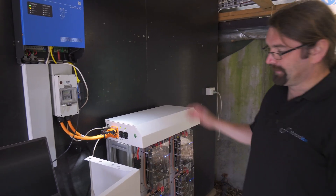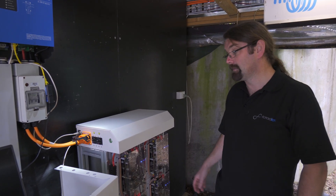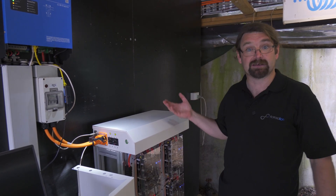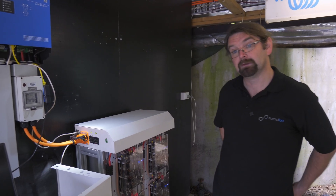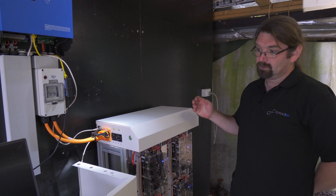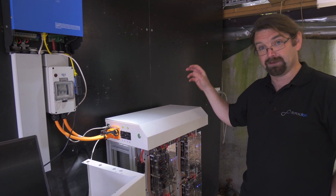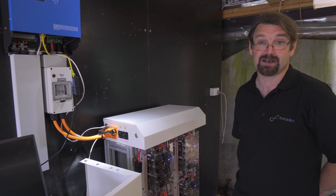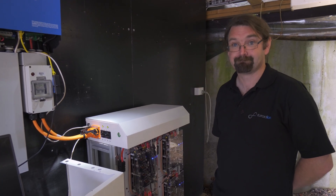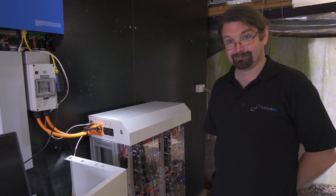What do we call this area at the top? These are the electronics bays. The power electronics and the master controllers for all these different boards are all held in here. It has things like fuses, contactors, and any CAN processing parts. The circuit breakers here are a bit unusual — they move. They're remote-actuated units. Rather than being a normal circuit breaker which you flick on and off yourself, these wait for a signal from the BMS. The pack has to be entirely happy before it will start to close them and send itself into a pre-charge. So it does its own pre-charge with a single connection to the PCE. To turn these on and off — really just that little circular green light. Yes — that turns on the electronics, which then control the circuit breakers in parallel.